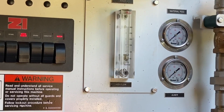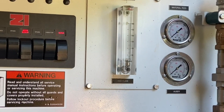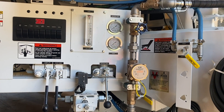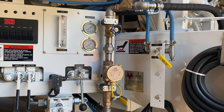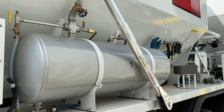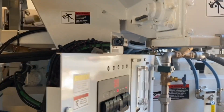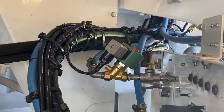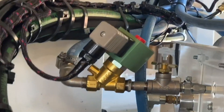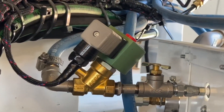The flow meter is sized to deliver a specific range of admixture, which is determined by the mix design and the calibration of the mixer. The flow meter, along with the size of the tank, determines whether the system is a high flow or low flow. The admixture delivery is started and stopped by the admixture solenoid valve, located at the back of the operator's panel on the outlet port of the admixture flow meter.